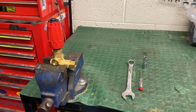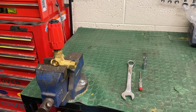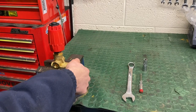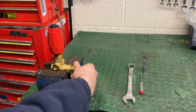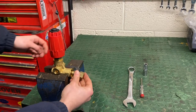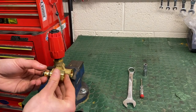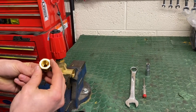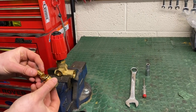This is a quick video on checking a V-series mech line unloader valve for problems. First thing you're going to want to check is your front shuttle. If you take a 24mm spanner, undo this front bolt. When you take it apart you should have a torpedo, a spring, and your front end.